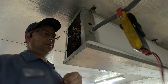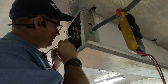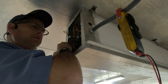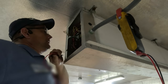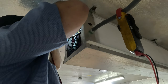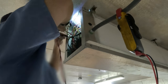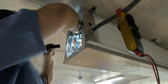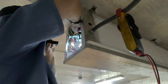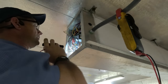We've got our meter going. We should have power on Switch 1 and 2, which we do — 205 volts. Let's go to terminals 3 and 4 and see if we've got power there. Still no power. That orange wire is coming down to H1 and the black wire to H2. So our problem is the transformer — it's junk. We just need to replace it.